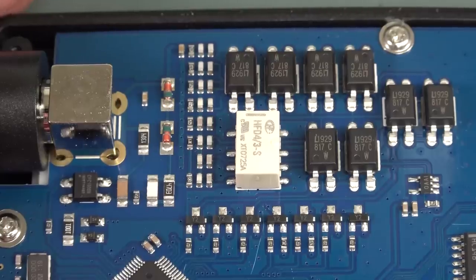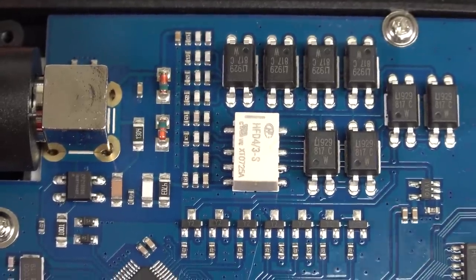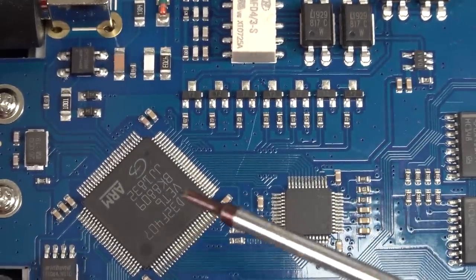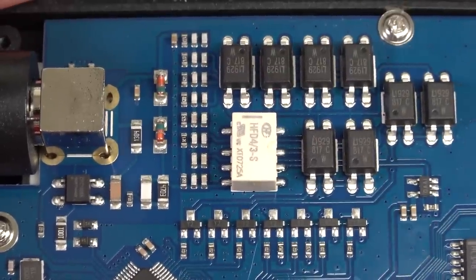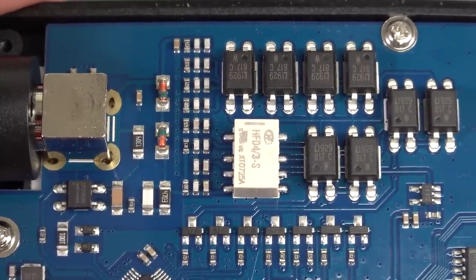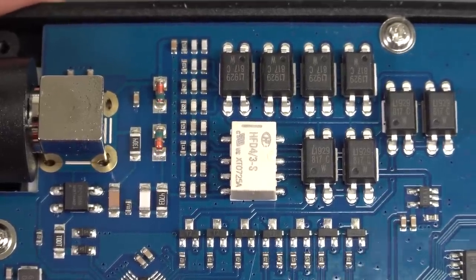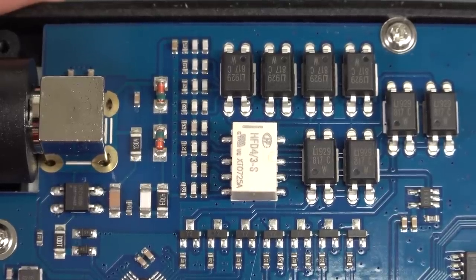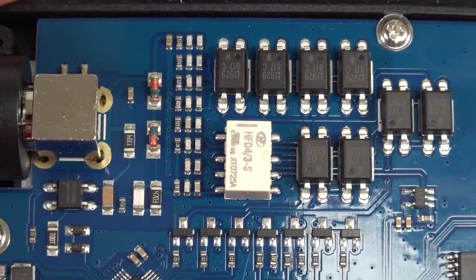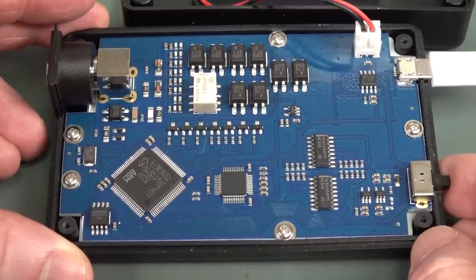So basically, they're just asking this poor little front-end circuit to do too much for 100 meg, and it's just coming a gutser. I like the fact that it has some software offset calibration and things like that, but this is not by any stretch a professional oscilloscope front end that you'd find in your Rigols and your Siglents and your Keysights and everything else. We're used to pretty simplistic front ends these days, but this is too overly simplistic. So I can't possibly give this thing a thumbs up. It just doesn't do the business.